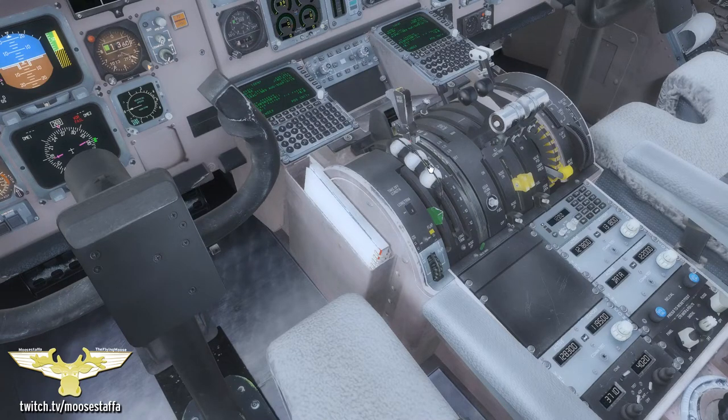You can barely see it moving right here behind the suitcase handles. That noise is just the indicator that the stabilizer trim is moving. You'll get that whenever it moves. It's not an indication that you're doing something wrong. It's just an aural warning, so you know that it's moving, because it's very important to know that the aircraft trim is moving when you're flying the plane.